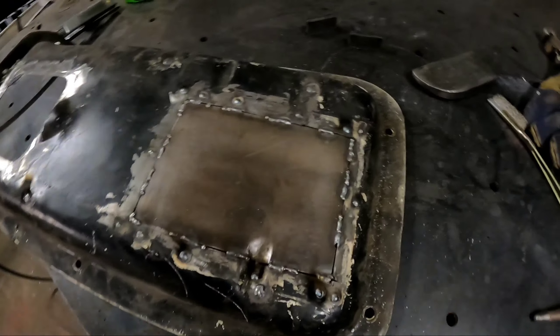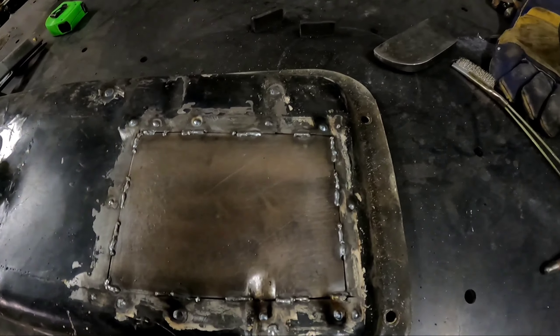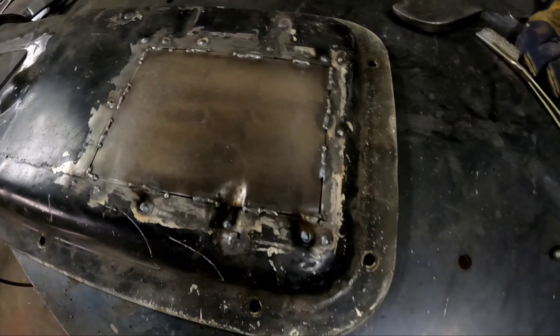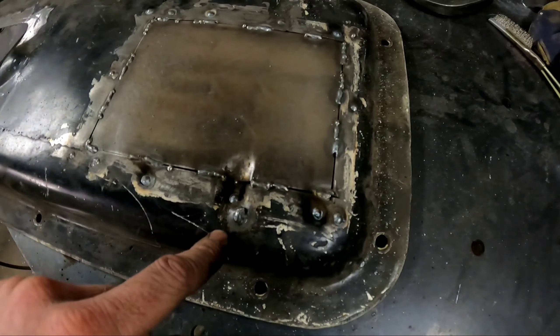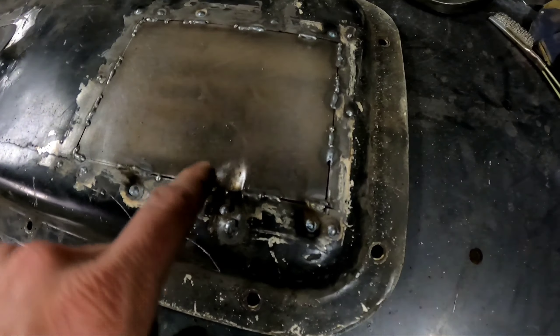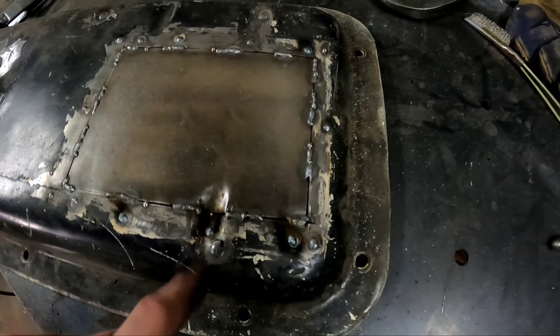I found a piece of steel that didn't have the bead roll in it, but it was a nice clean piece and I reckon I had to go to it with the EasyFoss — that's why it's still not rusty. So with this sort of bead roll here, instead of using a bead roller, all I did was just open the vise up and use the ball peen and just put that curve in it, because it only needed to go to there to finish this line off.